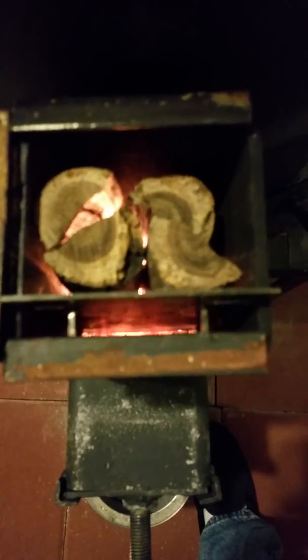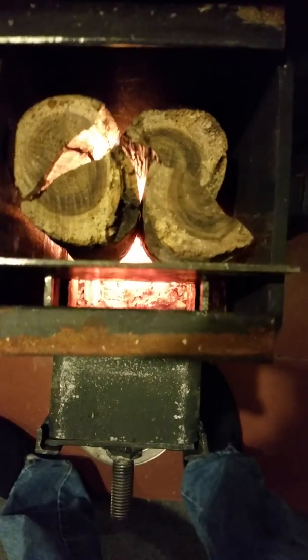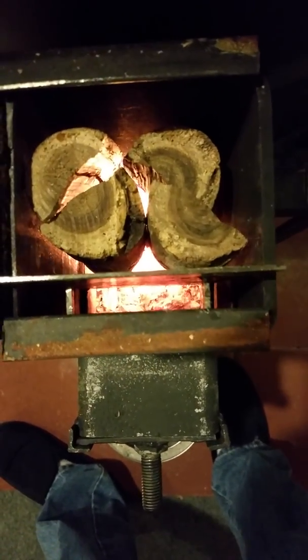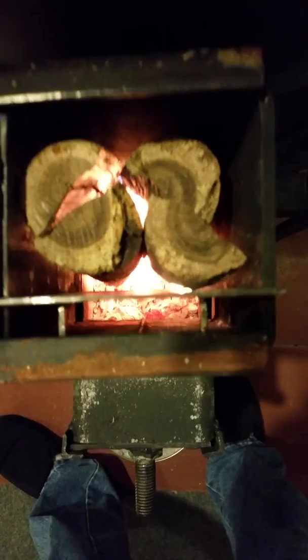Just a general improvement — if somebody is having problems with their rocket heater loading up with just hot coals and not burning enough, try limiting the wood going in and provide an air chamber going down to the back. That forces the air to go across all the hot coals. Seems to be working pretty good so far.